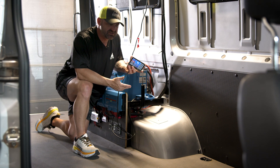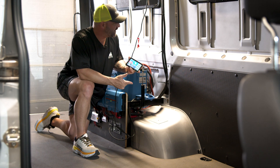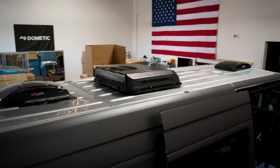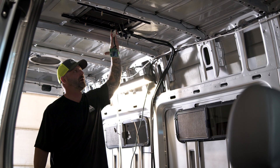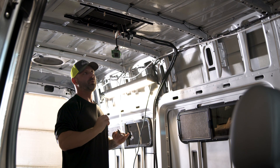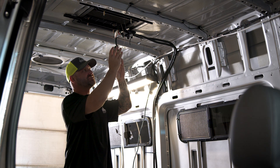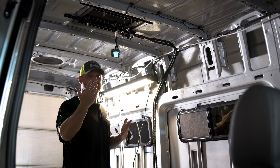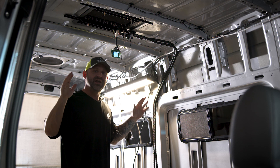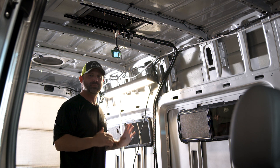If you have any questions about this electrical kit or any components within the kit, give Nomadic Cooling a call or drop us an email. This entire system is set up for the Nomadic Cooling air conditioner — that's the whole reason we're here. We have the Nomadic Cooling air conditioner set up with two AWG wires running up to the control panel. When testing your air conditioner, you don't want to touch the control board on the outside — doing so could break it. While testing you can have it hanging and press the power-on button. This is a great time to verify everything is working by loading the system at 100 amps rather than just 5 amps for a max fan.